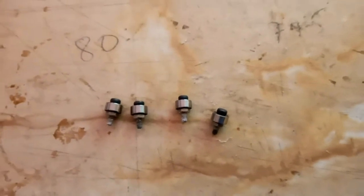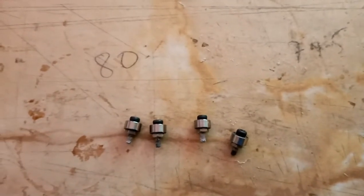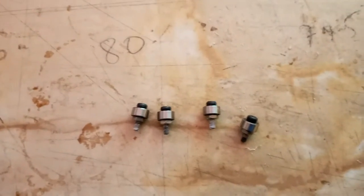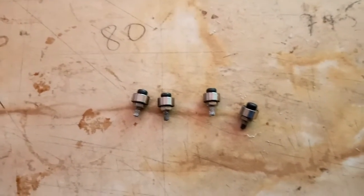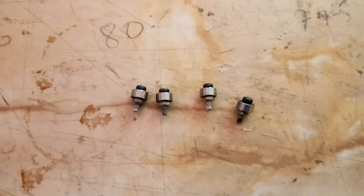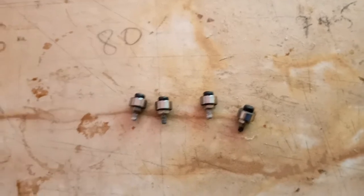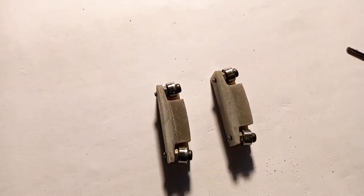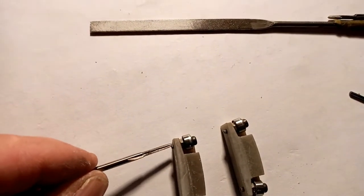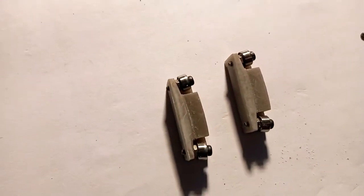Next task is to prepare the bearings that will support the turntable, and they are 2mm diameter inside by 6mm on the outside, and we pass a 2mm socket screw through each of those, with a 2mm nut on the end, as I've already prepared. We will now fit those to the parts that we 3D printed earlier on. Right, I've added mine in. Next we need to add just a small bit of super glue onto the ends of the threads where they just poke through in the four locations, just to lock that in securely.